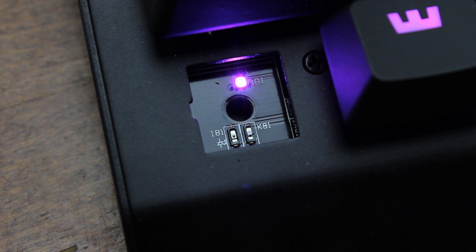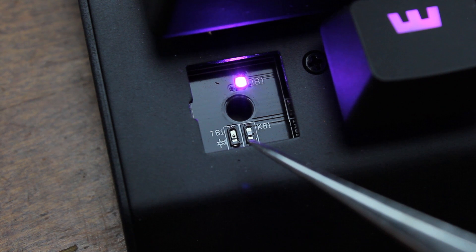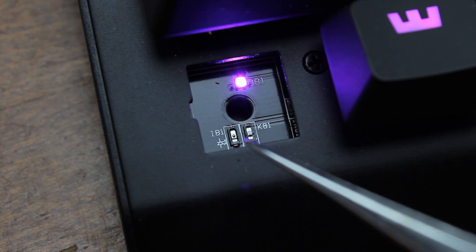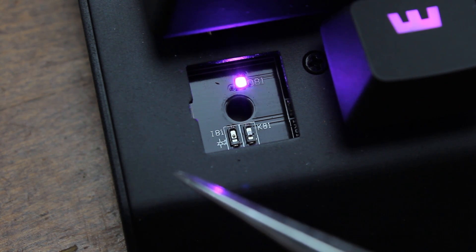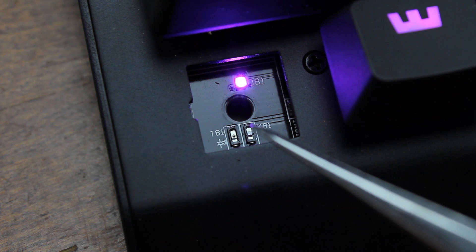In contrast to the Bloody design, the LED and photoresistor aren't actually inside the switch — they're soldered onto the PCB, with the switches positioned above them, which allows for hot-swapping of the switches. This massively complicates the issue, however, as rather than just having the illumination source directly opposite the sensor, the light now needs to be directed from upwards to sideways and then back down again, all in a focused pattern.